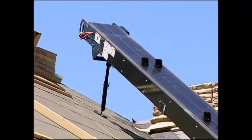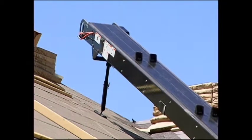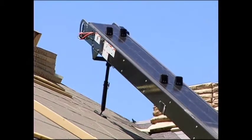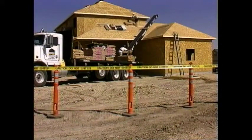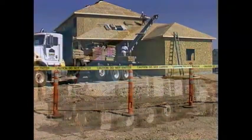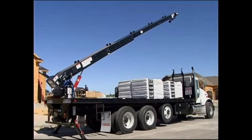When all material has been loaded onto the rooftop, shut the conveyor belt safety on-off control to the off position before leaving the rooftop. Before moving the conveyor back to the truck, check the safety zone to make sure it is clear from any objects or people. Raise the conveyor slightly and reposition the conveyor support leg.